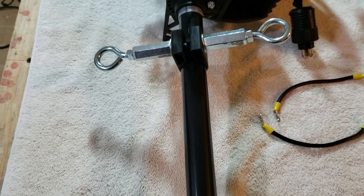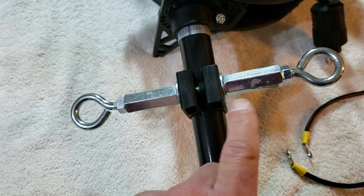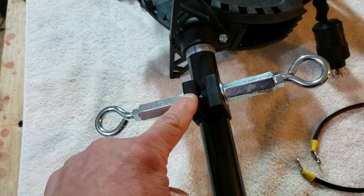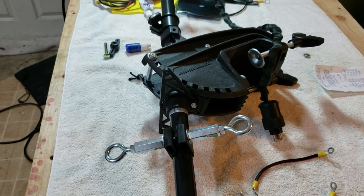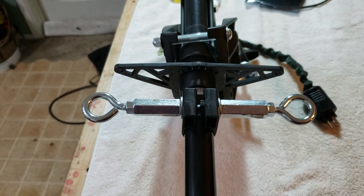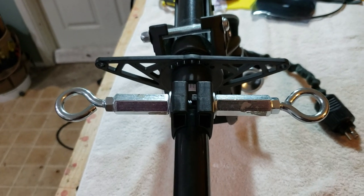There it is, installed on the shaft of the Minn Kota with the torpedo triangle right above it. As you can see, it fits very nicely and tightens down very nicely. Make sure you put Loctite here so it stays where you want it, and then you can attach whatever steering cables you have right to this. It's going to be very durable. The nice thing about these snap-around brackets is that they flex enough to snap around the bar without taking anything apart — I put it on in between my clamp and my motor without disassembling anything. It's a little bit wider than the torpedo steering triangle, but you could either shorten the thread couplers, or I bet it would work with my system with zero modification.